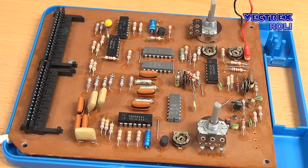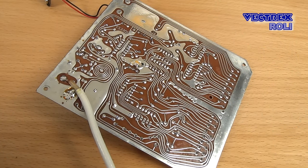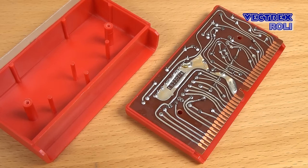At the end of this video I thought it might be interesting for you to see the PCB inside the main unit — it is an old school single layer PCB with several discrete components and a few integrated circuits. As I said there is no CPU and no dedicated Pong chip built in. Also the back side of the PCB is interesting to see and the way this was produced you don't see that often anymore in modern devices. There you also see how they did a coil directly on the PCB. Here we see now also what's inside the badminton game cartridge — again it is just a PCB with a few discrete components and no ROM chip there.